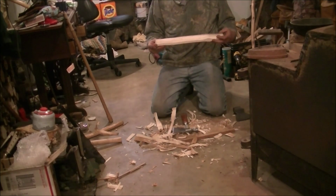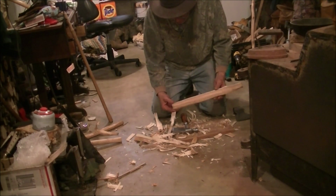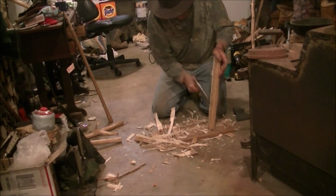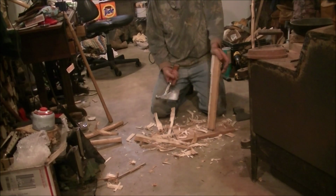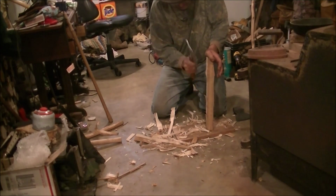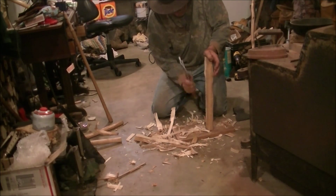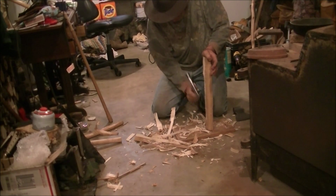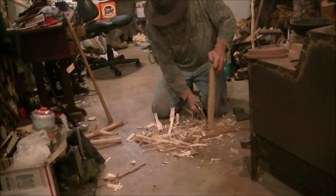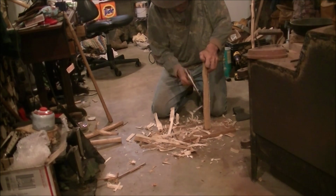But that's a very nice piece of wood. I don't know what that crack is. I didn't have that before. You can see it's kind of two-toned. And basically you just, I do that with straight grained wood. If you start up here and you try to go all the way, sometimes you get a massive split, which we don't want. So I tend to chop into it with the edge of the axe about what I want to take off when I go down that time.